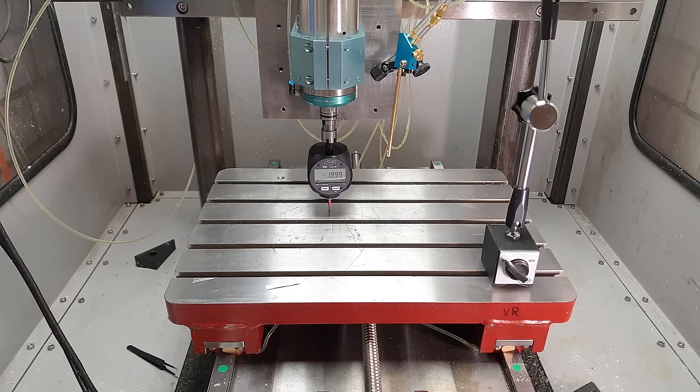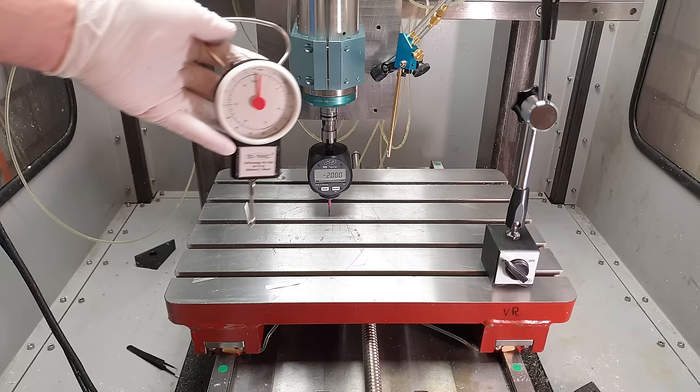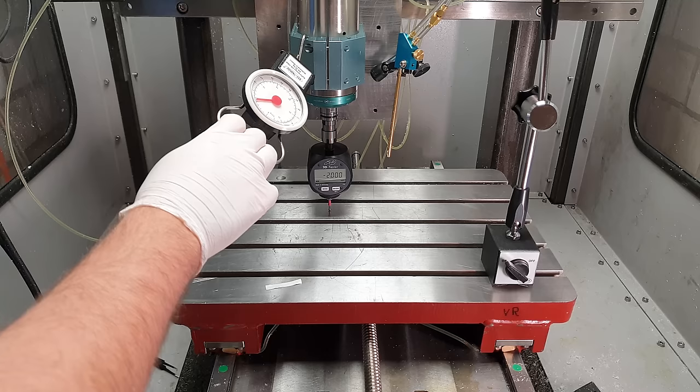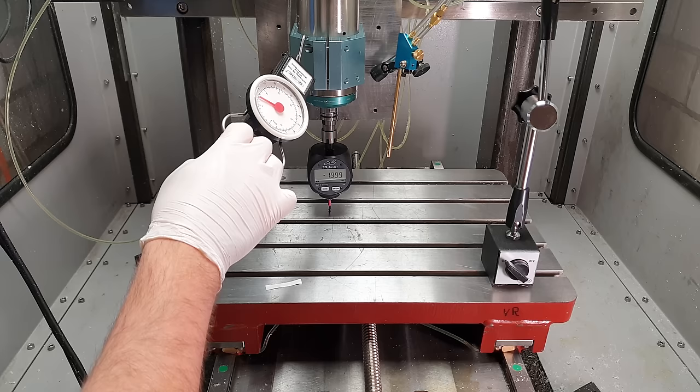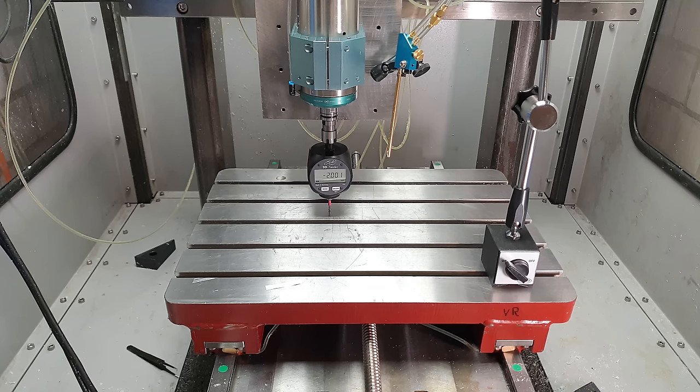I think my machine will be able to maintain all of these adjustments in almost all situations. I don't expect normal cutting forces to ever exceed 25 kilograms. So the only sources for higher gantry deflection are machine inertia in abrupt movements, resonant vibrations, and accidents. But I'm not planning to have any of those, so we should stay within a single digit number of microns usually — that's about the diameter of a red blood cell, so I'm happy with that for now.